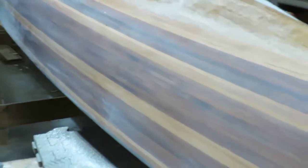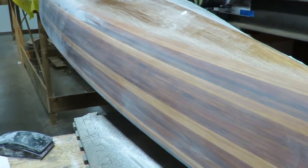Once we get the uniform surface where it's all the same sort of matte finish, sort of more like up in here. See? Up in here, that's totally uniform. There are no sags, no runs, no shiny spots. It's all that sort of matte finish. Maybe very small shiny spots, but very, very small. I don't know if you could even see where I was pointing there. You can't really see them. So that's what you're looking for. A really uniform finish surface, and that'll varnish beautifully.